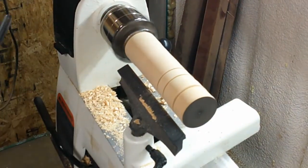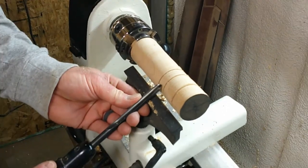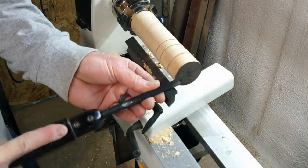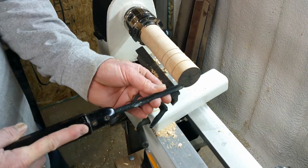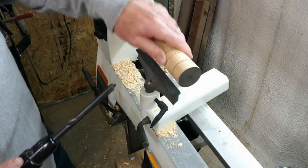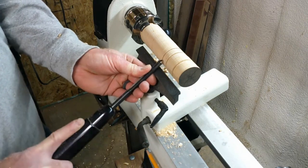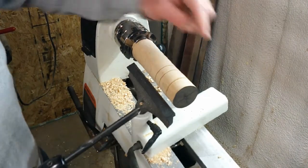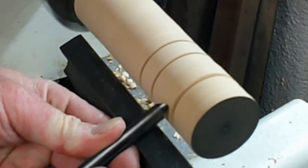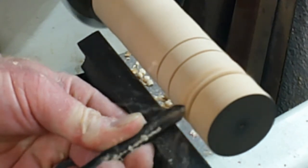So what I'm going to do here is a bead. When we start out a bead, we point our finger down the flute going to the right. I bring my tool up and as I bring it up I'm going to rotate it just like this. I start in the center of the cut — about three-quarters of an inch to one inch. This one is going to be elongated. I did speed the lathe up a little bit to do more detail work. We anchor our tool, find the bevel, and when it starts to cut, now I'm starting to bring it up and rotate.